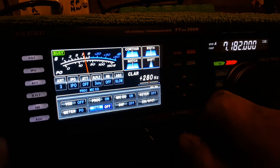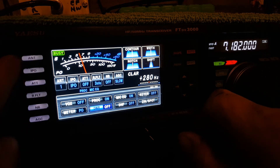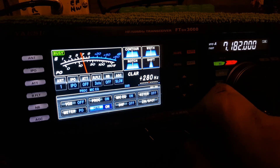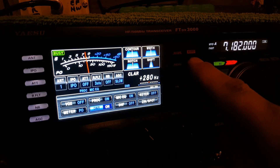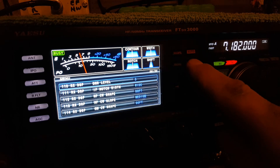You can't copy them on the dipole. We'll see if the DX are still in there — the band's changing because it's dark out now. Nice copy with the DNR settings set to default, though it's a little much for my liking. I could probably turn the effect down a little bit. With the Yaesu rig, you can easily go straight to that menu setting by pressing and holding the select button that you'd normally press to turn that function on and off.